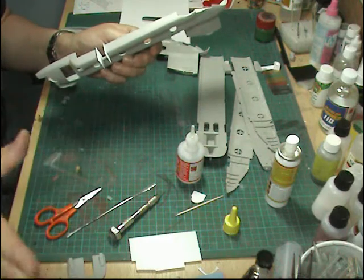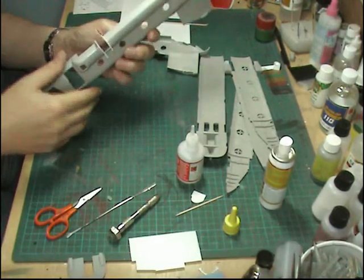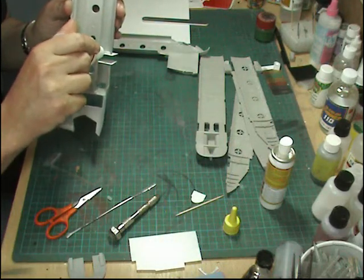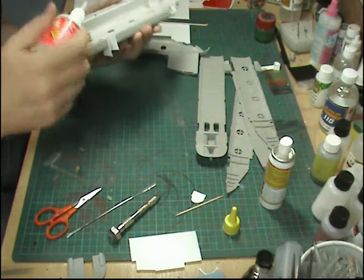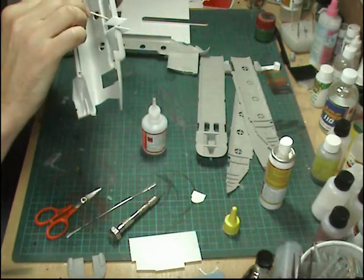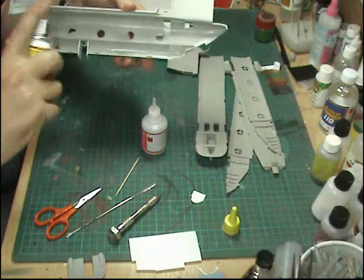I've got some stills on the site which show me putting clamps in to hold them open, but since we're using super glue it's not so much of a problem. What we'll do is chuck a lot more super glue on the insides just so it works itself round, and then if you take a cocktail stick you can literally just drag that around to help the capillary action of the glue - just like so.